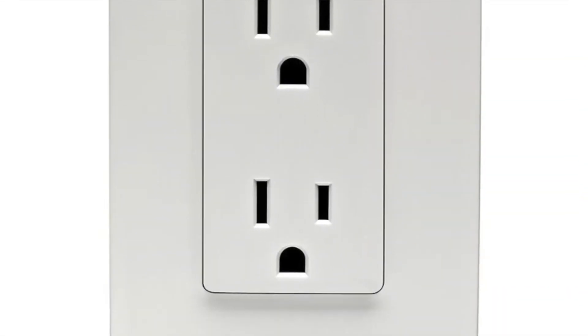While you won't be able to supply all the power to your appliances, you can make this work with a 15-amp 120-volt outlet — the simple kind of receptacle you see everywhere in your home. So if you have a generator with at least one of those, you're probably going to be able to at least keep the heat on in your home, assuming that you have a gas or oil-burning furnace and not electric heat, which usually requires 240 volts.